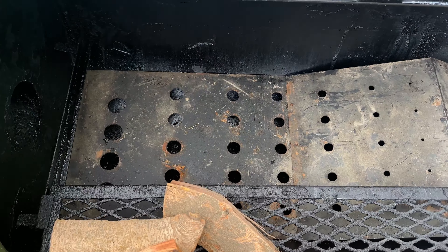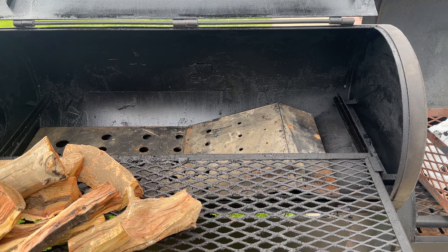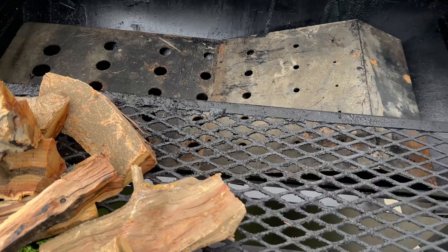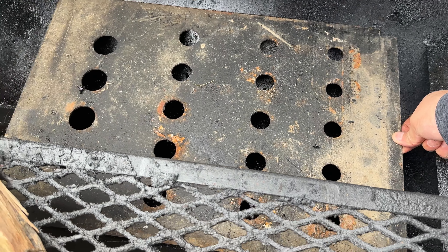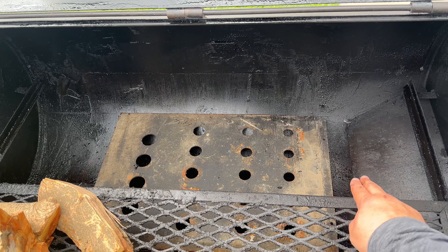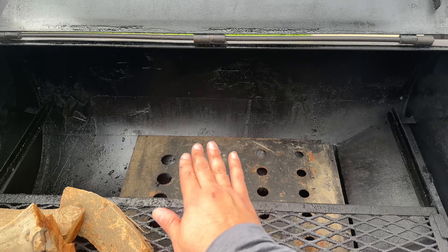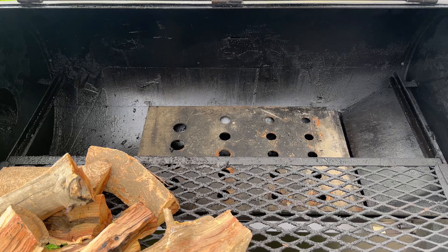So that's kind of how I had it set up right now. I haven't really researched how it works, but that baffle obviously, as you can see, lifts that up — that could be an issue with this area here, with anything burning, because that's going to radiate heat up to the grate. So I may just eliminate that one altogether and do something more or less like that. I think having a little gap here, or maybe even closing it somehow like that, will distribute it, because the air is going to go down, reflect up, and then come this way. Usually the hot zone is around here, which is really where I want to be cooking.